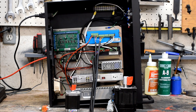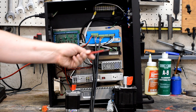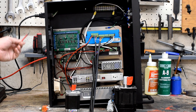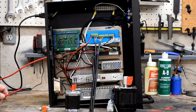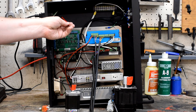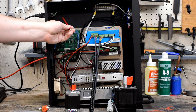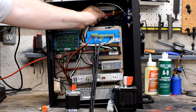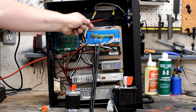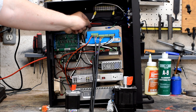Here we are all together. This is our rack mount case, and here is the aluminum plate that we machined on the X-Carve using the same dimensions as an ATX motherboard to mount all the components to. On this side we have an aluminum plate machined on the X-Carve to fit the same space as the standard ATX power supply, except now we have a power plug that comes from the wall. On this side it's soldered to three lines — they go over to this switch which switches both neutral and line at the same time, and ground goes down to the common ground of the aluminum plate.